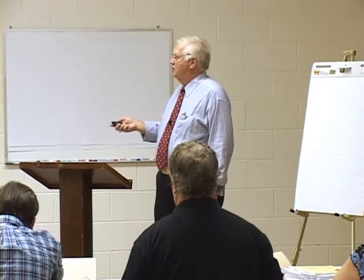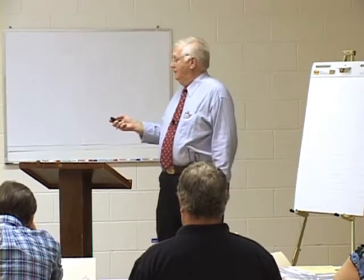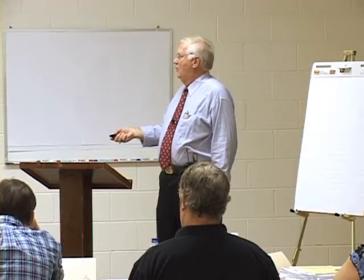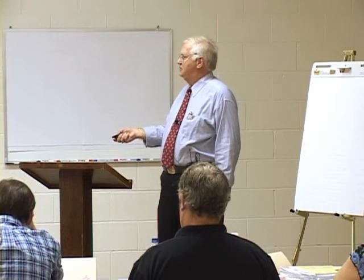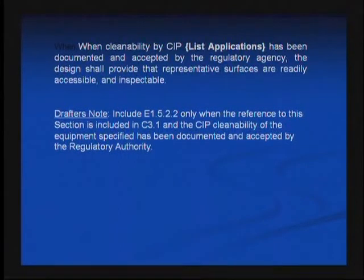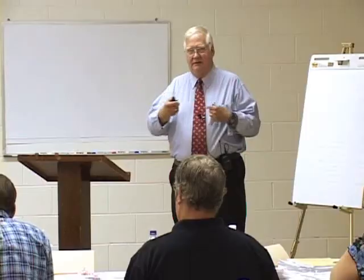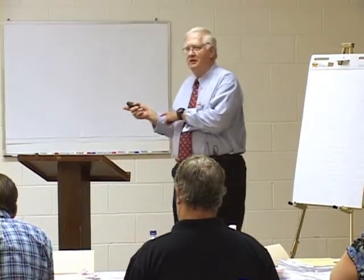Specifically, as it says here, there's a drafter's note that product contact surfaces to be CIP cleaned are inspectable — which is the old mechanically cleanable — or product contact surfaces that are inspectable except as specified in E1522, which is an internal cross-reference to a section in the fabrication section. That cross-reference basically says when cleanability by CIP has been documented and accepted by the regulatory agency, the design shall ensure representative surfaces are readily accessible for cleaning. This ties back to the older, more specific CIP definition.